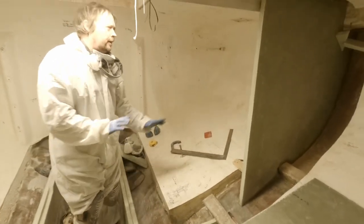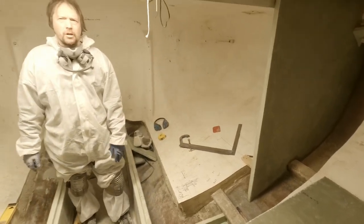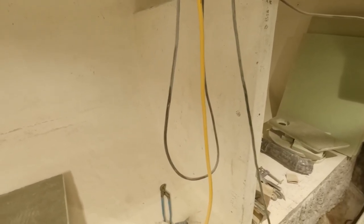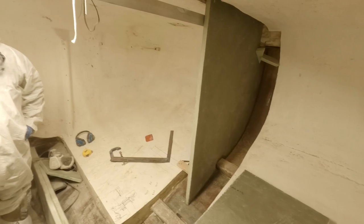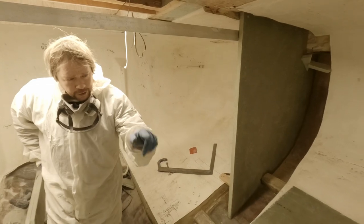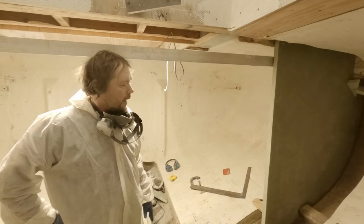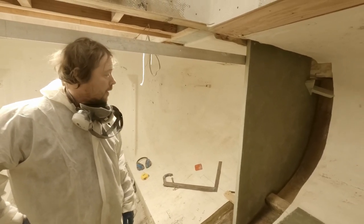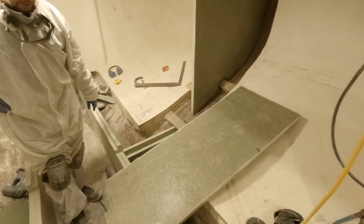We're going to get a lot of rigidity out of that, a lot of framing. It's going to make this wall solid as a rock. Make it nice and clean too. We had aluminum C-channel that was the bin board holders before. So that will eliminate the need to put it on our brand new foam wall. We won't have the penetrations for the bolts going through, which is one major advantage of it. And then it's a lot easier to clean. It doesn't corrode.